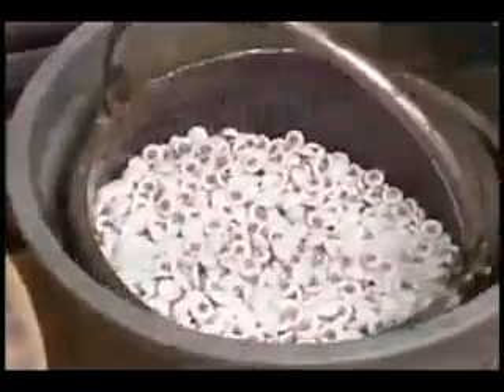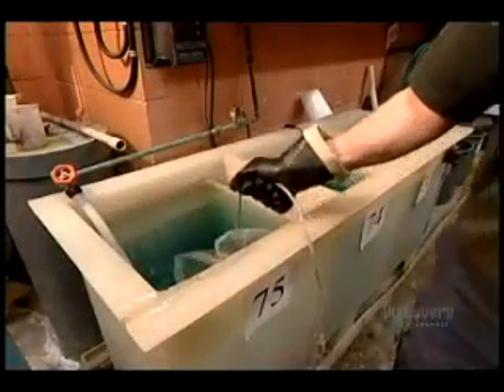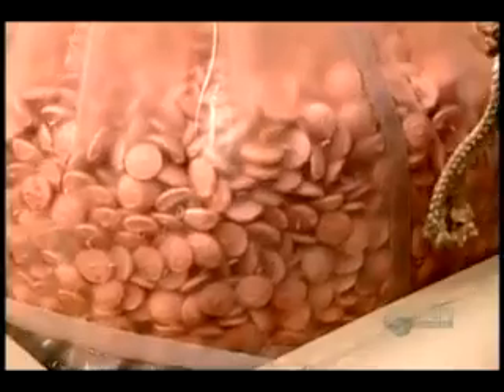They cool the molded buttons in a basin of cold water. Some specialty buttons go on to be gold plated, but not before soaking in a chemical bath to clean their surface so that the plating will bond well. As a rule, only materials that conduct electricity can be metal plated — plastic, of course, is non-conductive. However, this company has managed to devise a way to gold plate plastic buttons, exactly how is a closely guarded secret it's not willing to divulge.